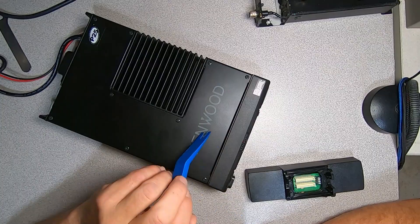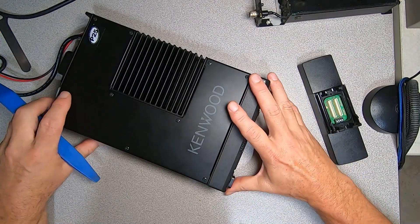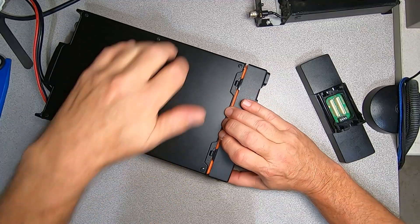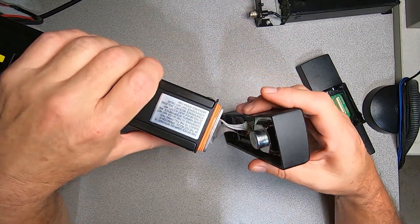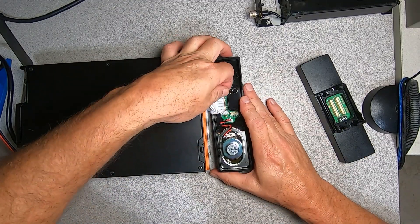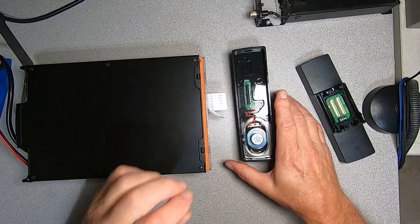Let's start our control head conversion of this VM8000. Those of you familiar with Japanese radios will certainly be familiar with the layout of these connections. Let's go ahead and flip this over. These tabs right here we just need to lift up to the next side, and you'll see there's a seal — make sure you don't damage the seal. As we take this apart you can see there's a connector here which we use our fingernails to pull, and then we have a ribbon cable here. Lift either end of your ribbon cable up.